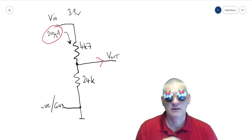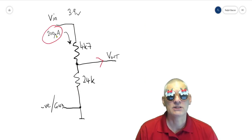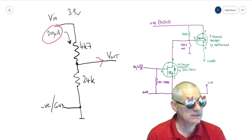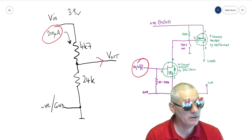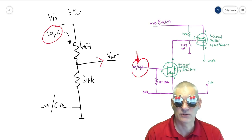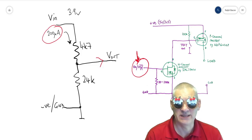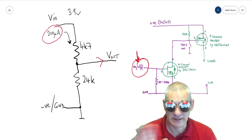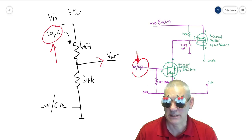The solution is to switch this off — and we already have a circuit for that from a previous video on auto switch-off. It's a two-MOSFET device using a P-channel and N-channel pair to interrupt the power supply, with the Arduino's GPIO pin turning it back on. A GPIO pin drives the N-channel, which then switches the P-channel gate effectively to zero, allowing current flow. If you get those MOSFETs in a little dual package, it's very easy to implement as part of the auto switch-off, bringing that 200 microamps down to basically nothing.